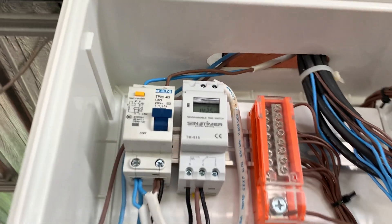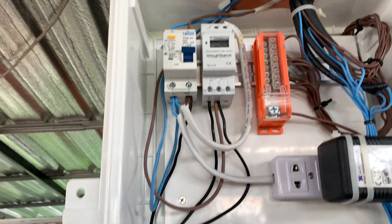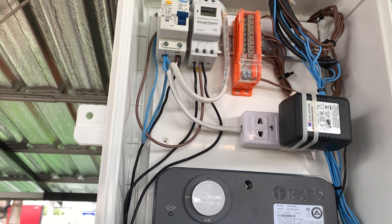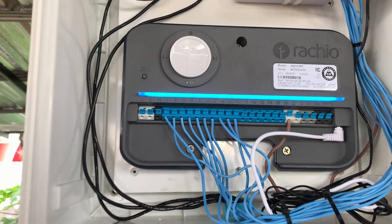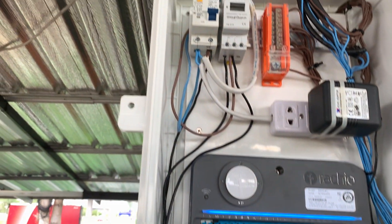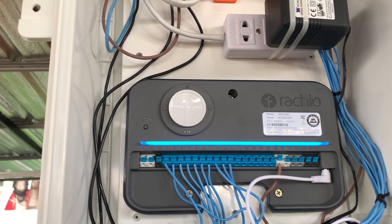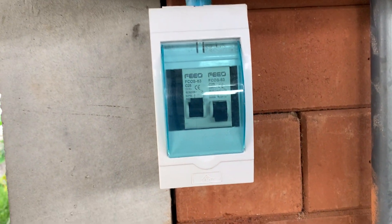The main line also goes into this little device here, which is a timer switch that goes off to the pump. The pump I've got is a manual pump — it's not stop-start — so rather than leaving it running and blowing any pipes, we turn it off when it's not in use. All these blue lines go off to the different sprinklers, and when they come on the timer switch turns the pump on, so the sprinklers and pump are running at the same time.